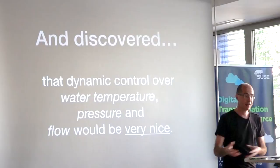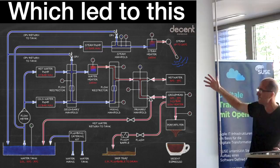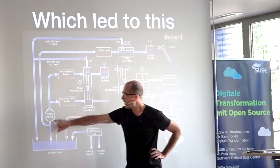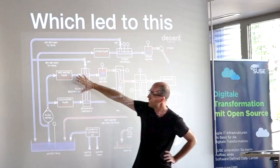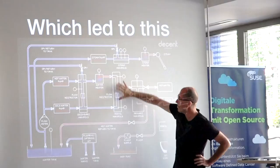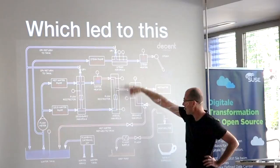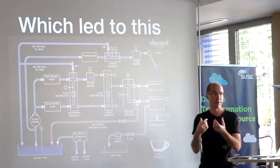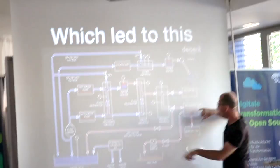This is the hardware schema from three years later. We have room-temperature water going in, a hardware flow meter, and two pumps — a hot water pump and a cold pump. The hot water has a separate circuit running at 110 degrees centigrade under pressure. It goes through a heater, and then we mix them together with temperature and pressure sensors. We use the temperature sensor at the coffee to change the water mixing upstream, because the coffee has interaction effects with the water. What we're really interested in is the temperature at the coffee, not the temperature upstream.